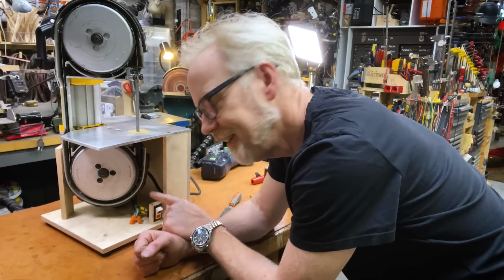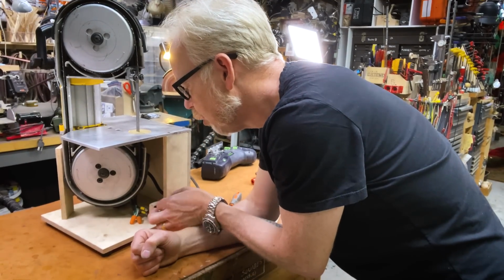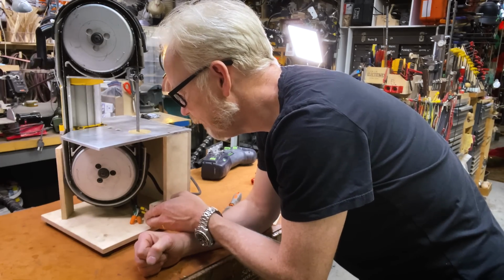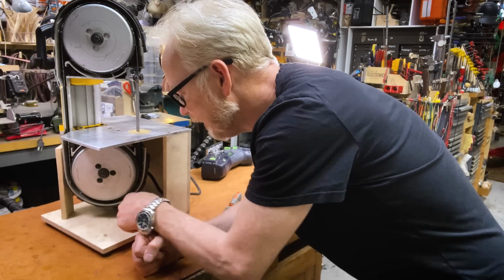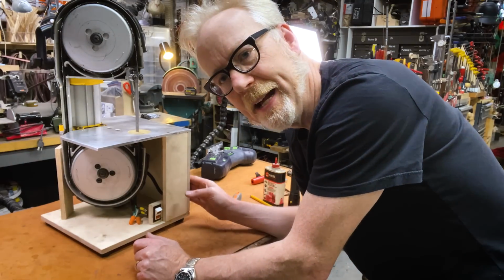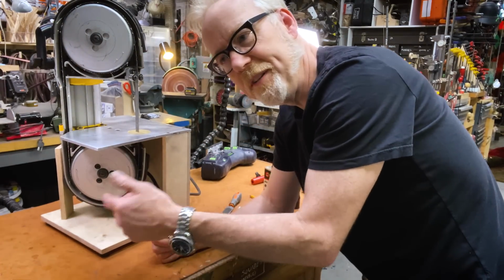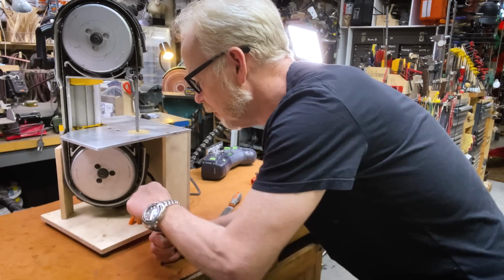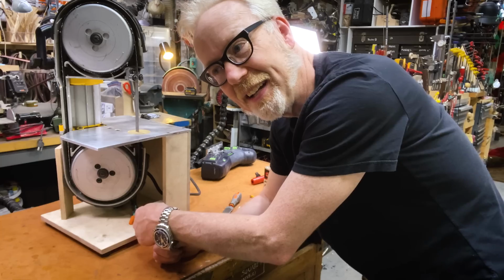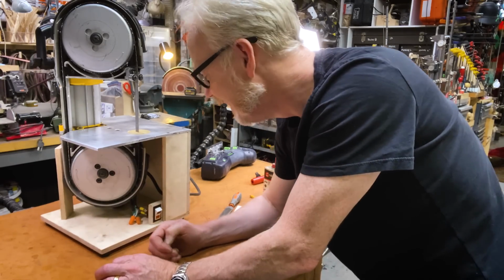So when I'm looking at this housing, I'm thinking that what I really want to do is make a quarter inch ply little shroud with three sides that allows this wire to go through, but butts all the way up right against the wall. So that is going to create the least amount of ingress for any metal powder. But I'll also use a couple of screws to hold it in place so that it's removable, right? I got to be able to service this thing.